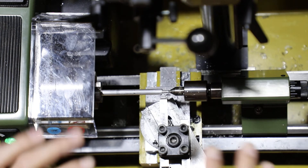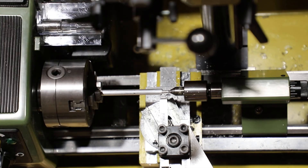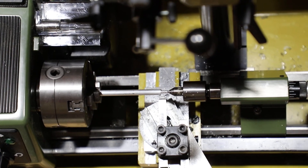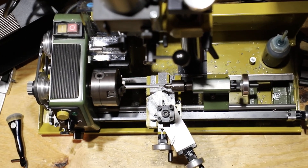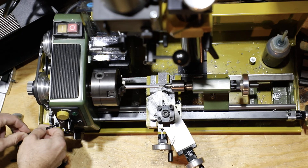That's basically right at 4.8mm. Now we're going to chamfer the edge, chamfer the tip, and then prep the rest of the outer surface of the material to achieve our 40-millimeter length post. In order to do that, you no longer want your drive belt on, so we're going to disengage the gears, kill the power, open up the box, and remove the belt so it's no longer driving these gears.